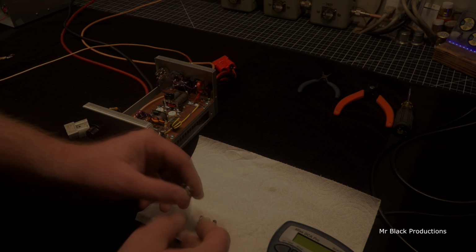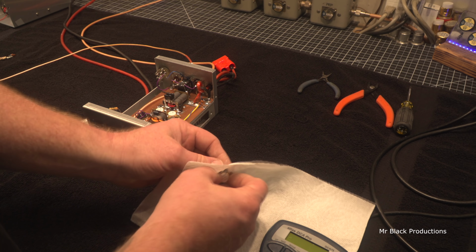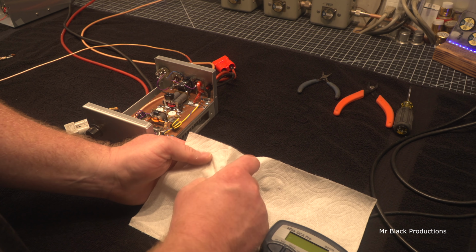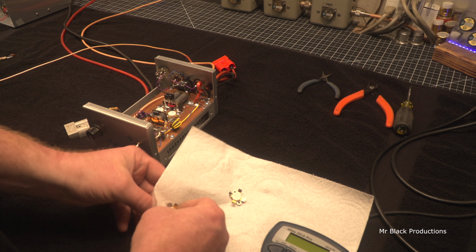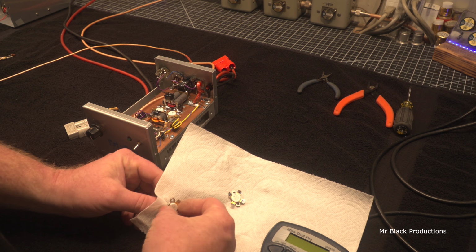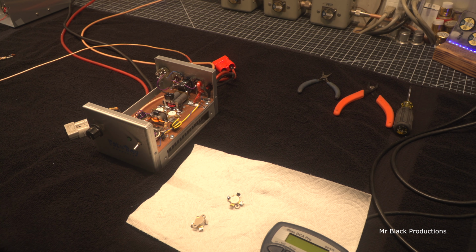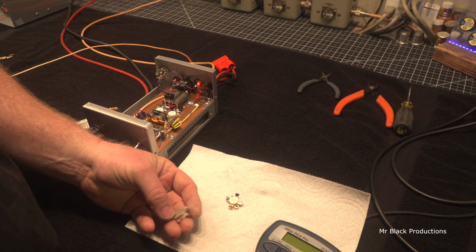Like I was saying in the previous segment, this is the Atlas DCA75 Pro. Now there are some technicians out there that poo-poo this transistor checker: oh, it's not an absolute tester. Look, all we're trying to establish is if the transistor is good, or if it's bad, and give us a rough gain number.